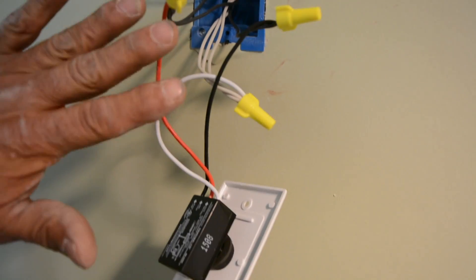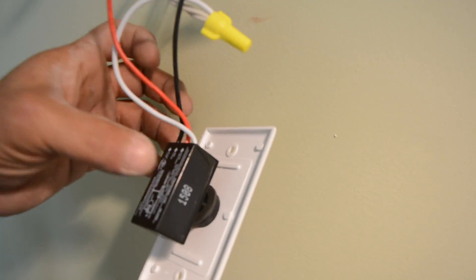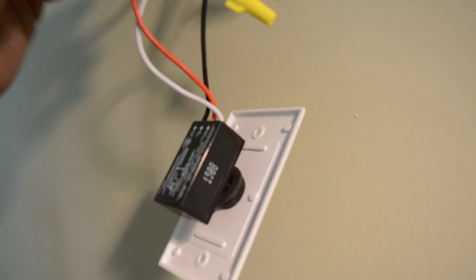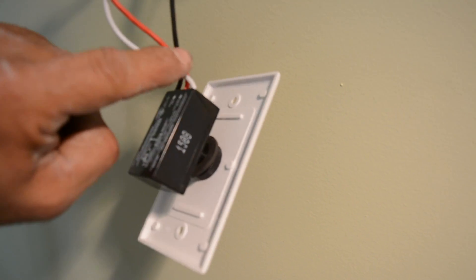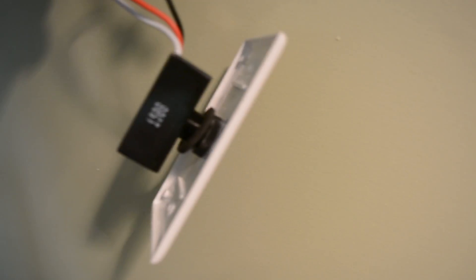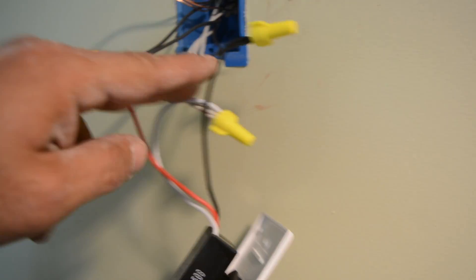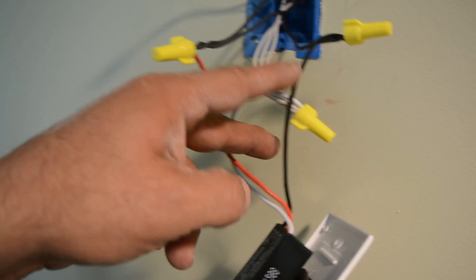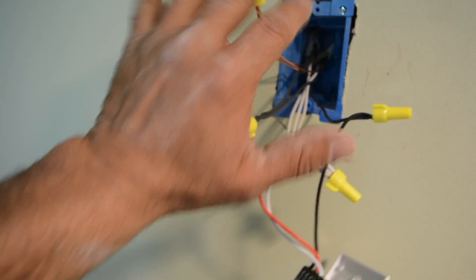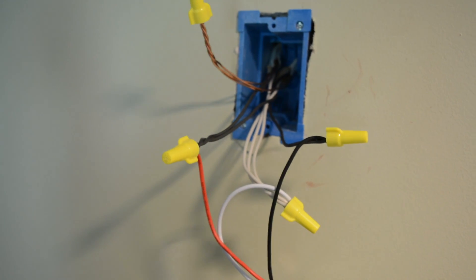All right, now I have all the wires connected. I have our white wire — our neutral for our switch — connected to all our neutrals. I have our red wire, which is our load wire — this is the wire coming out and providing power to our two lights. You can see we have our two hots for our lights connected to that. And then our power in supplying our switch with the power — our black wire — and our grounds are all terminated together. So now push all this nice and neat back in the box and put our cover on, then we can energize our power and give it a try.